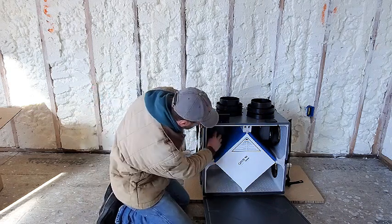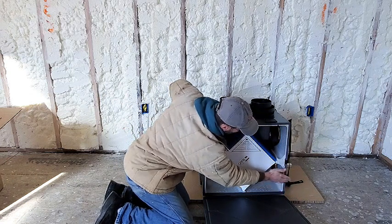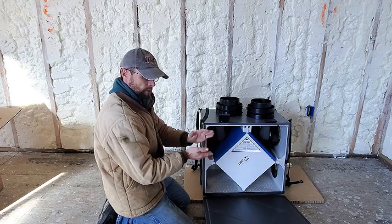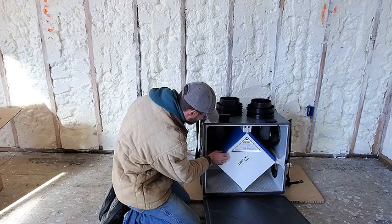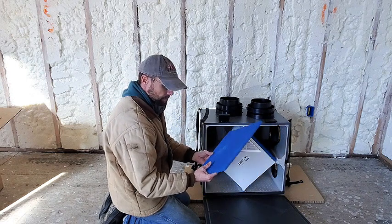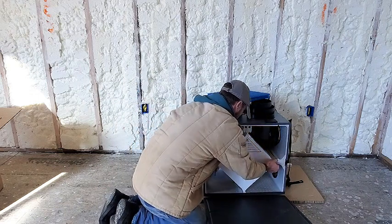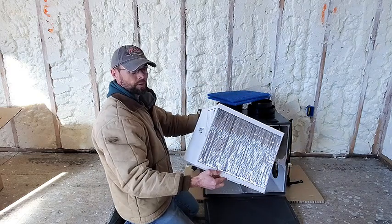The air will come in here - here are our motors, fan motors, dual motors. They'll come in, go across this large filter, and out into the house. The exhaust air will come in from the house, cross over this filter, and then back out. The way it's set up is you have alternating layers that are sealed off from each other, so the air could flow through this way but the air coming across here will help transfer that heat and humidity. There are filters you can just clean, and you can get better filters for these too - up to HEPA and some better options. There's some maintenance required for cleaning these out every now and then.